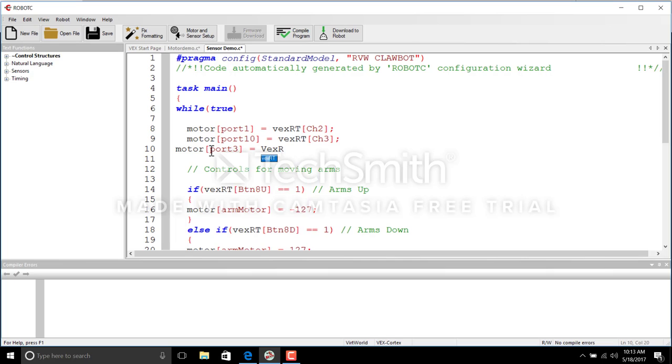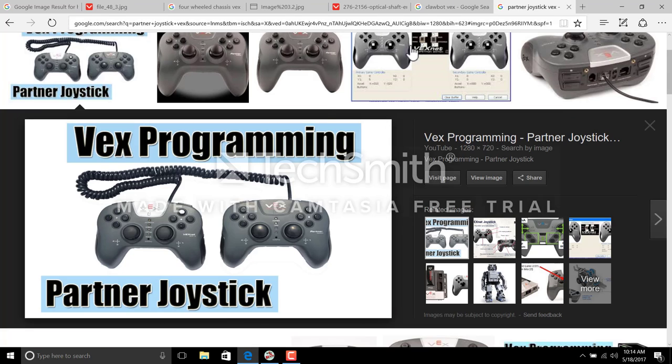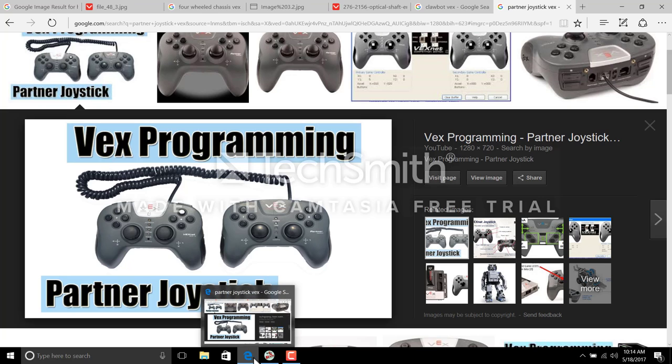So what I mean is, if I say RT and add a parenthesis, I'm gonna say it's gonna be channel one. And if you see, Robot C actually gives you this. So for example, channel one, XMTR2. If you click MTR2, it's going to set XMTR2. This is going to be the secondary controller for your Vex drive chassis. So for example, if I have a competition where I want to control this joystick and my partner can control this joystick from over here, when he presses the toggle for channel one to the left and right, he's gonna control the motor that I have connected to port 3.